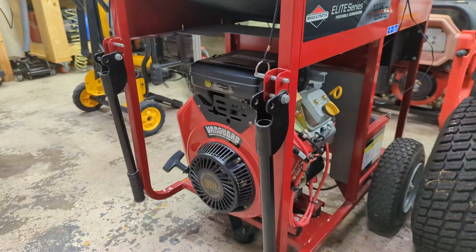That's probably enough yapping. So now the next step is I want to eyeball the harmonic distortion of that generator head. I don't have the fancy equipment to actually give me a number. Total harmonic distortion usually expresses a percentage. You can usually eyeball the curve and get a general idea of how good it is.